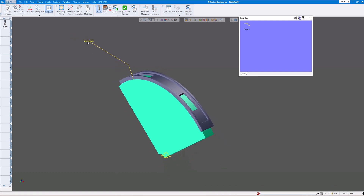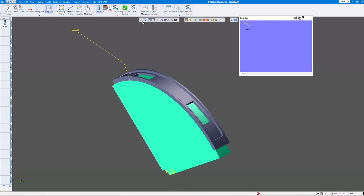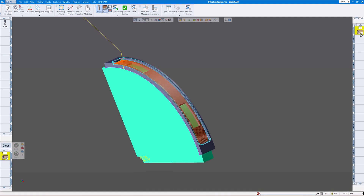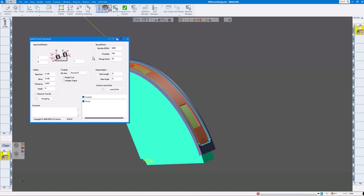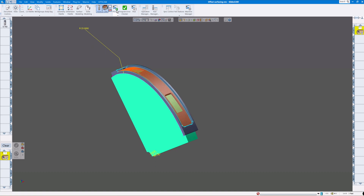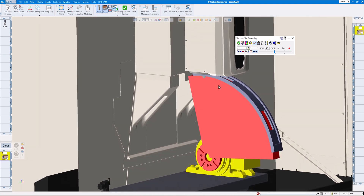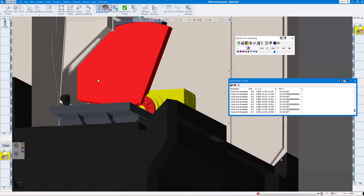Well, the problem is here's my fixture. When I turn on my dimensions you can see that's a radius of 23 inches from the center. You're thinking, well I'll just wrap it — turn on my geometry, do standard polar and cylindrical and wrap my geometry around there and go for it. And since this has a Y-axis offset I'll just bring in my fourth axis. If you have solids, everybody has this fourth axis capability now. That toolpath looks really good — I can cut that pretty easily. But let's go to our machine, and right off the bat you can see there are some major issues. The Z doesn't have enough travel, and if you were to run this you're getting all these over-travel alarms — it's hitting the casting of the machine.